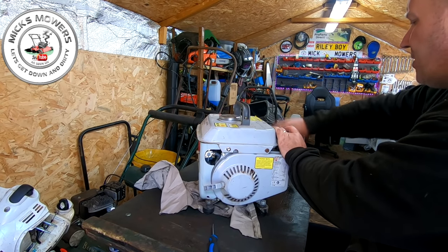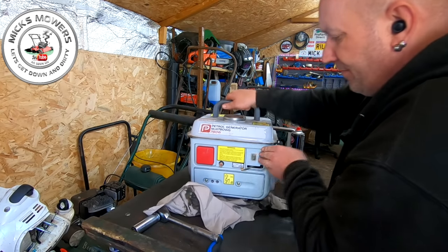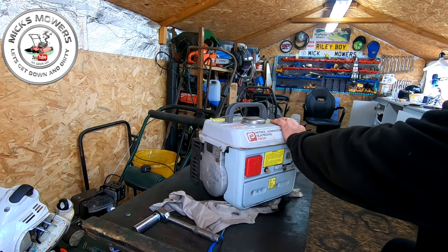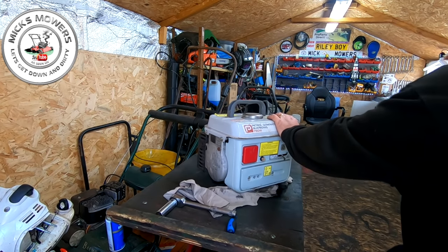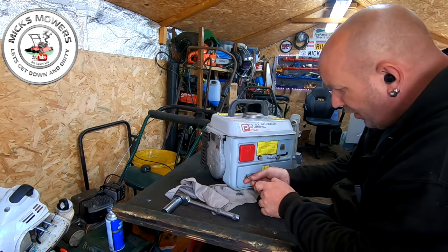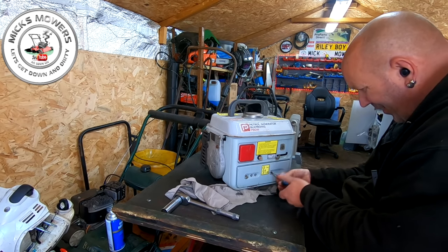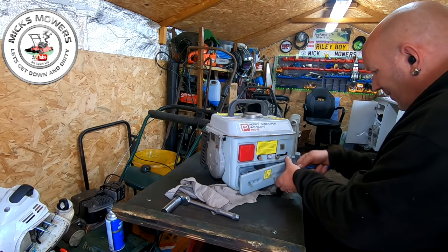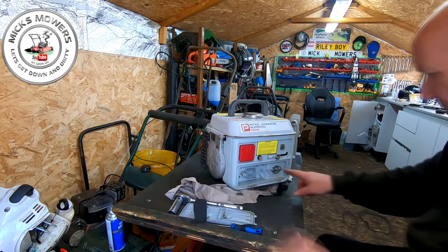It's a bit smoky to be fair so I'm not really going to sell it on, but it'll do me just for out in the garden and bits and pieces. Right, let's try that — see if it fires. It's definitely turned on. Just go bang — and it went bang. So it definitely is the carburetor. To do the carburetors on these is relatively simple. Two flat head screw bolts to come out on the front panel, and with those two bolts out you can then remove the front panel. That comes off, got a little air filter there as well.